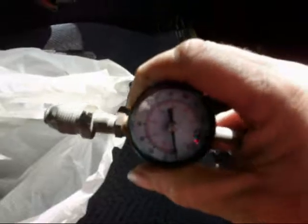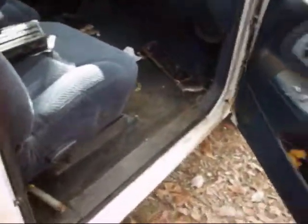So I made this adapter because it screws into the propane tank, and there's a pressure gauge, and then this end right here I'm going to put an air hose fitting on it — these are adapters down to size. So I can have the gas fire sitting in one spot and have the pump sitting however far away — up to 25 feet or however long the air hose is. It uses standard air hose, nothing special.